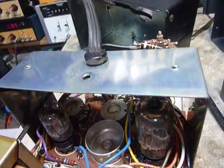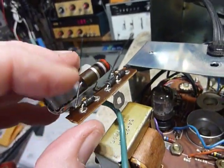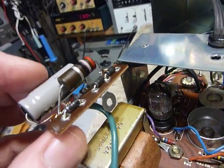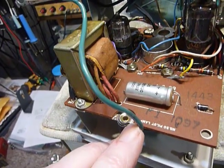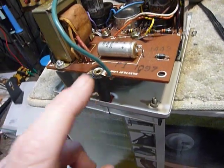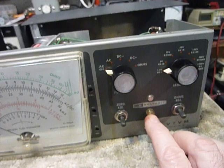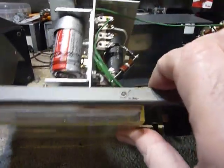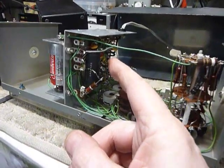This one has been converted to eliminate the C battery. You can see there are three diodes, a 27-ohm resistor, and a 100-microfarad capacitor. This is connected to the positive side of the 6.3-volt line. This one has a standard 6.3-volt bulb in it so you can do that. But this unit has a 110-volt operated neon bulb, so I'll need to make connections at pin 9 of the 12AU7 tube to get my 6.3 volts.